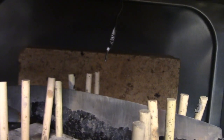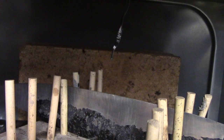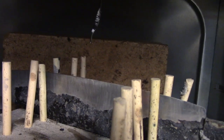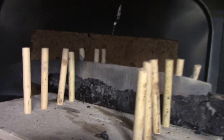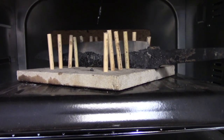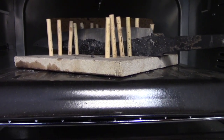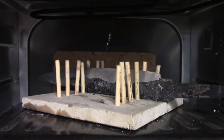And as you can see, that probe here, unlike the probe that's up here in the corner, the probe that I'm using is only about an inch and a half above the blade. So I'm measuring the temperature as close to the blade as I can at all times, so I get a more accurate read on my temper. Now here's the cool thing about this setup: unlike the even heat kiln, when I use that, you can't really open the door and regulate it at all. Whatever's going on inside there, it is what it is.